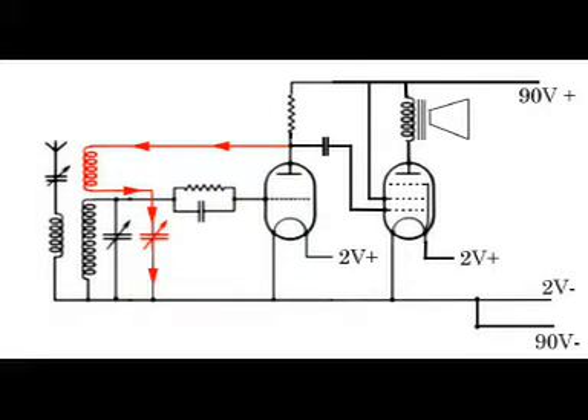But alternating currents — alternating voltages such as those of speech and music — can actually go through a capacitor, go into the grid and be amplified. And in the anode of the pentode is a loudspeaker, which has a coil and some iron, like an iron diaphragm, and a horn, which I've drawn rather crudely, I'm afraid. But it does work.